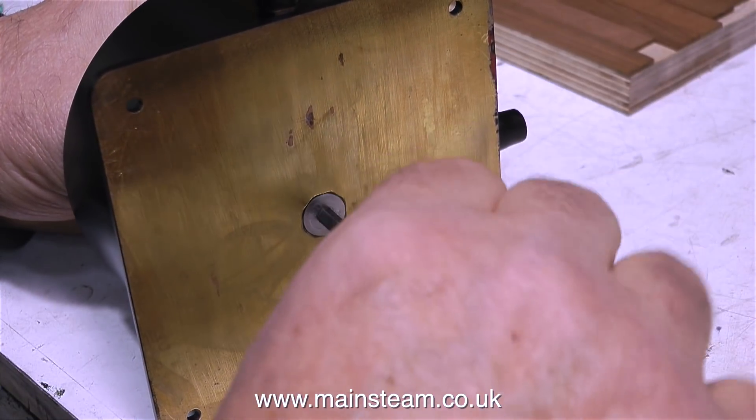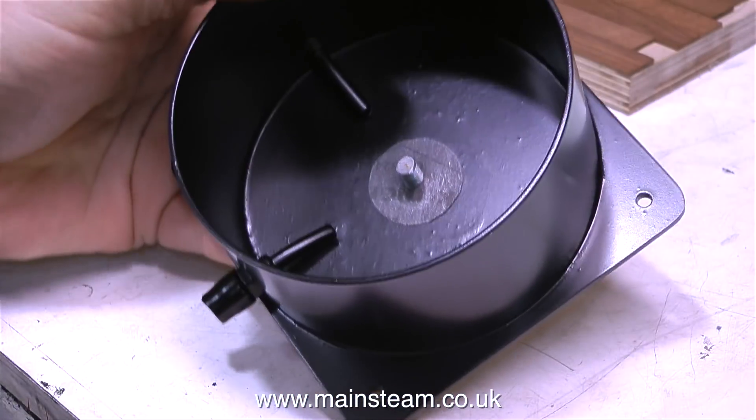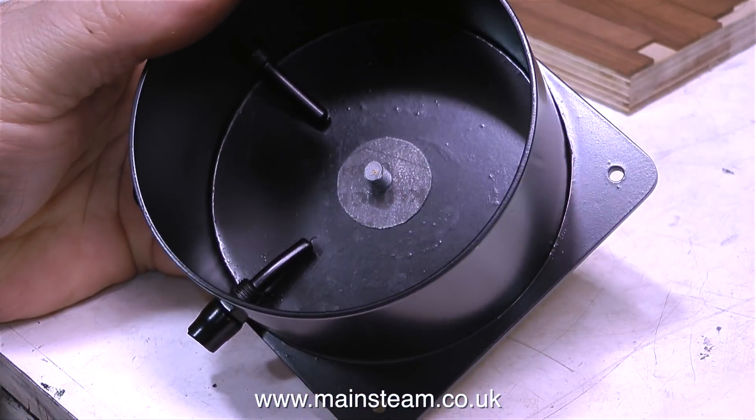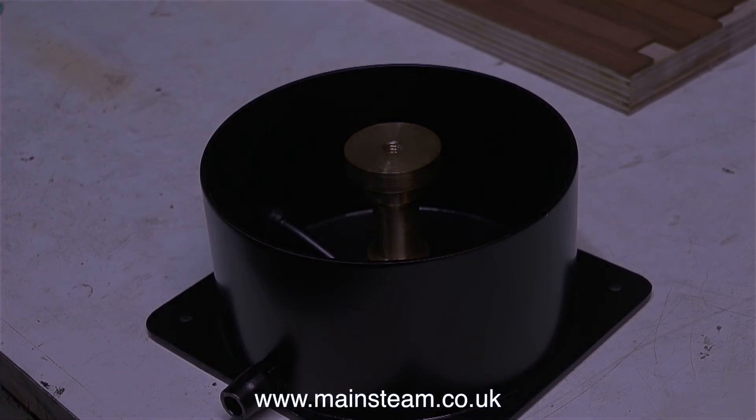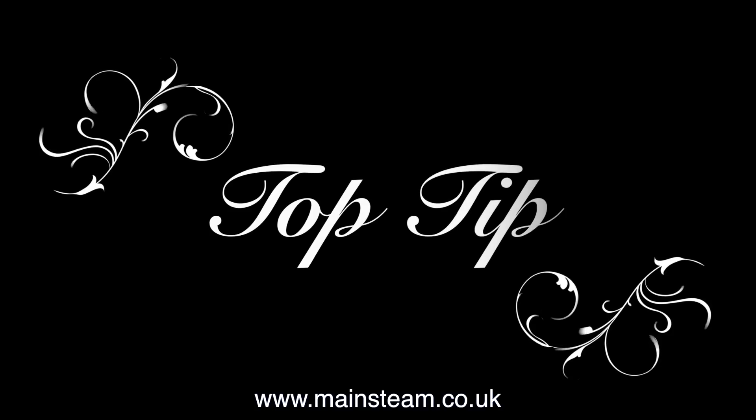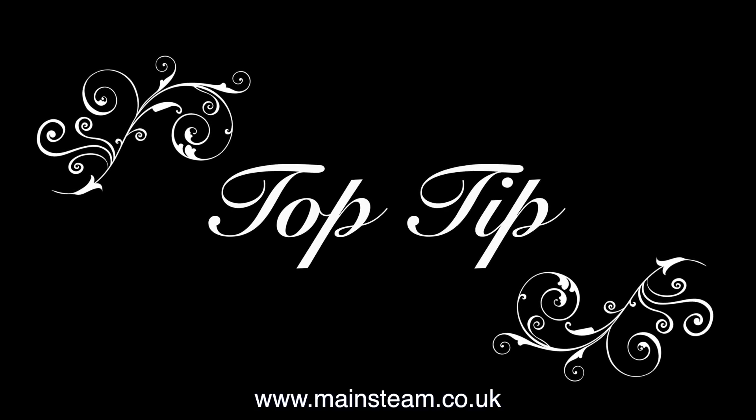I've made a couple of gaskets — here's one for the bottom part of the tank. To fix the support column in place I'm using an M6 countersunk bolt, and here's the column firmly fixed in place. As this is a water tank, and even though I fitted it with a gasket, I still needed to use a stainless steel bolt to prevent it going rusty.